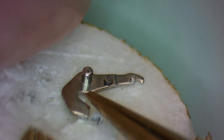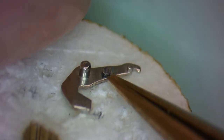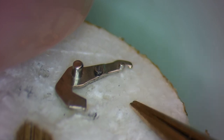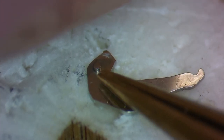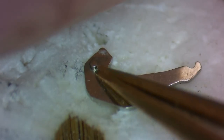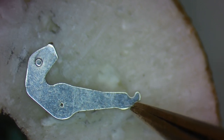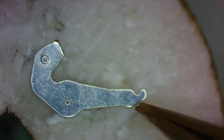So to start with, we have the long pin. That's the release pin that sticks through the hole that you press on, which pushes the locking pin out of the stem. This pin actually pulls the correcting lever into the second and third position. On the top side of the setting lever, this is the yoke pin. This pin sits in a notch in the setting lever yoke, that holds it in positions 1, 2, and 3. So that pin cannot be damaged, bent, or broken. And this little notch right here, that interacts with the pin on the corrector lever, which establishes the position of the first position, position 1. So we'll go ahead and put that in.